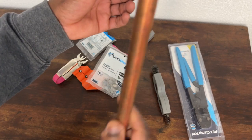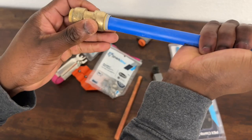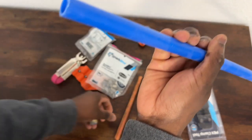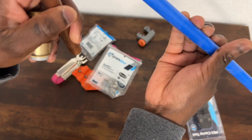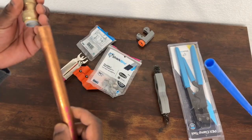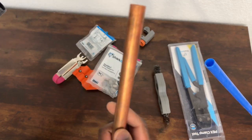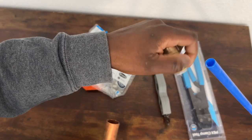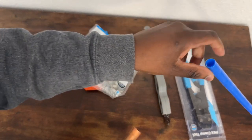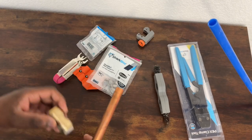When you're using SharkBite, you use copper like this. I've seen people using PEX on these as well. It used to be just copper, then PEX came along, and now you can use SharkBites with both copper and PEX materials. I love this because if you mess up, you can always take it apart and fix it. I'll show you how to take PEX apart when you use a compression fitting, and how to use a clamp or crimper.